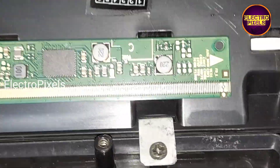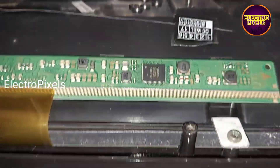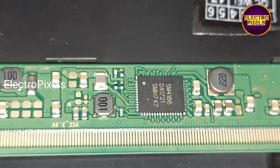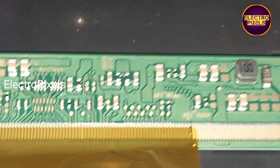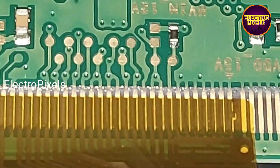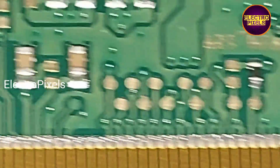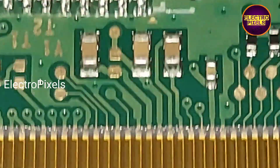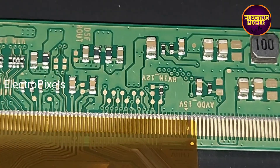The shorting may be from either the left side or right side of the glass panel. If both sides of the panel are shorted, the DC-to-DC IC named SM4186 goes into protection mode, and because of that it doesn't generate any basic panel voltages like VGH, VGL, AVDD, etc. So here I am going to cut down the right-side gate signal tracks from this panel.